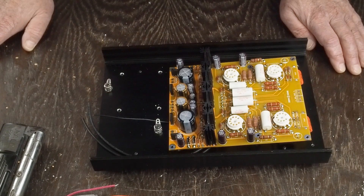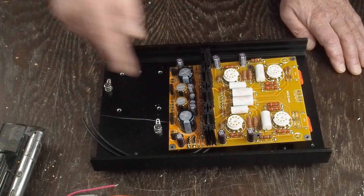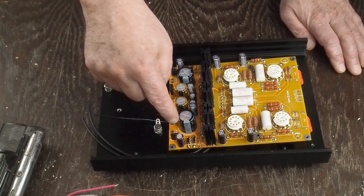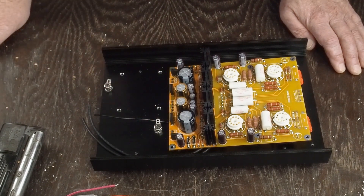There are techniques I've seen for lifting the ground using a bridge rectifier, a 10-ohm resistor, and a cap — things we may play with. But I really don't like the idea of a floating ground because if a component shorted and there was no board ground to chassis ground to safety ground, the RCA jack grounds could end up with 200 volts on them during a component failure and it wouldn't blow the fuse — that's far from ideal from a safety standpoint.